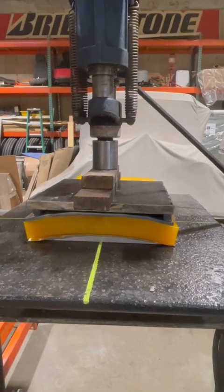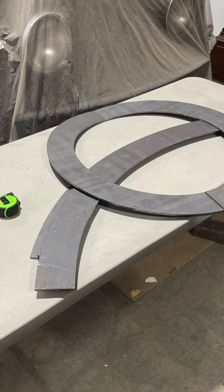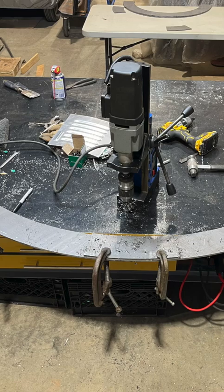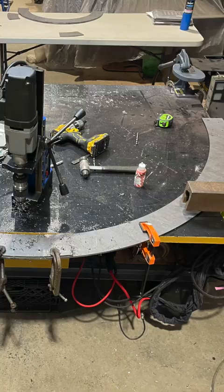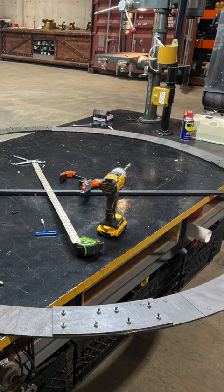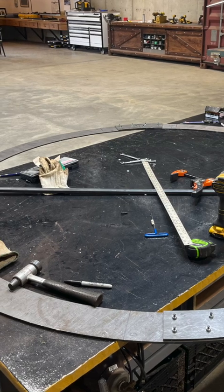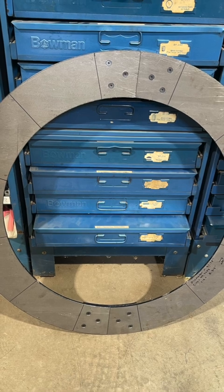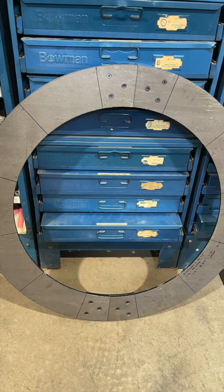So this is when I started on it. These pieces are the bottom and top rings that the main part of the capsule frame is comprised of. I think it was like 32 inches diameter at the top and 74 and a half on the bottom. I used mending plates to bolt them all together because I wasn't going to have a giant six-foot diameter ring cut. This was all segmented, and I needed it set up so I could take the whole thing apart to eventually move it into my house. That's the top ring all bolted together.